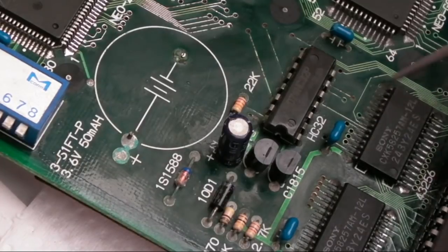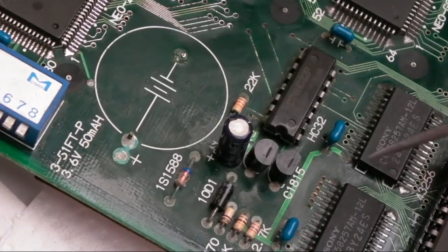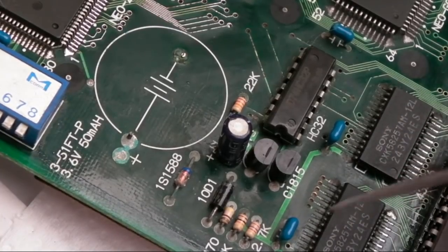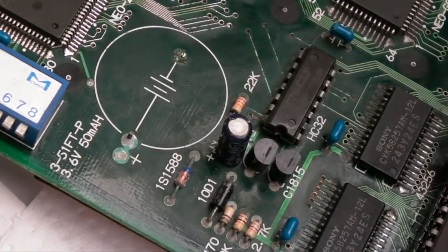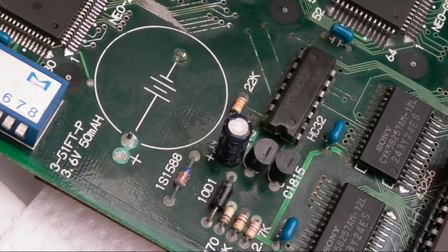And then this side here, I'll just do the same thing of, you know, clean with the fiberglass pen, add some flux, suck up the solder with the solder braid, reflow it, use the desolder braid again, and then give a final pass. They'll probably come up like new though, so this side's fine, and then this here needs reflowing as well.